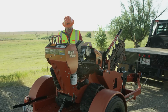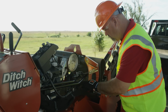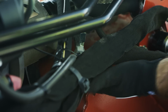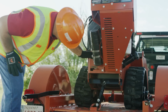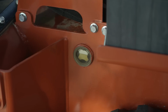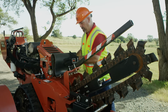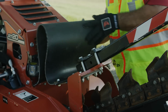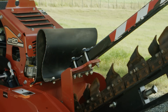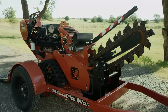Regular maintenance and inspection are essential to the safe operation of equipment. With the engine off, check all hydraulic hoses and connections for visible signs of leaking daily. Check the ground under the machine after it has been sitting for any visible signs of leaking. Check all fluid levels and refill any that are needed. Check the safety guards and shields for any damage and replace if needed. This includes verifying the bolts on your restraint bar are tightened properly and the operator's presence system is operating correctly.